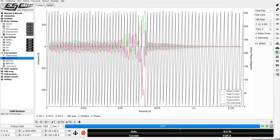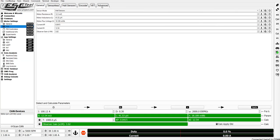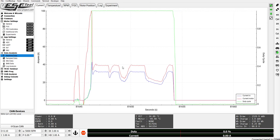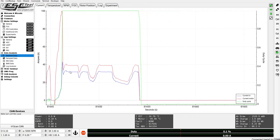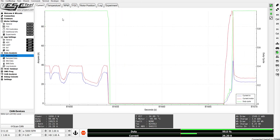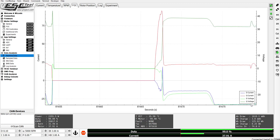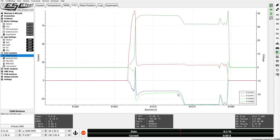With this particular motor, I found that 30 microhenries is a good value for the MTPA — that's the motor inductance difference LQ minus LD. You can hear that difference in pitch which tells you how much it adds to the RPM — the RPMs above the base speed of the motor. You can also see that negative voltage is injected here when the MTPA kicks in. That's the additional speed or RPMs that MTPA is adding.